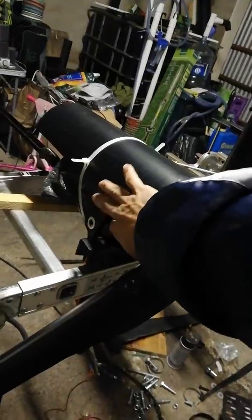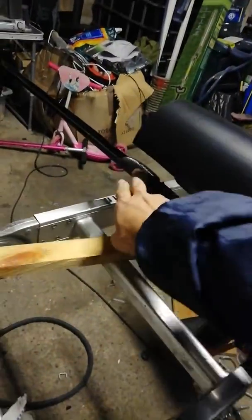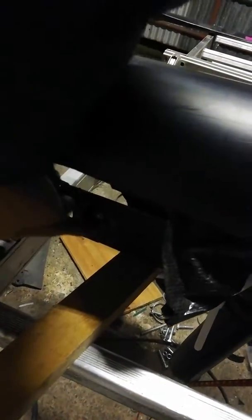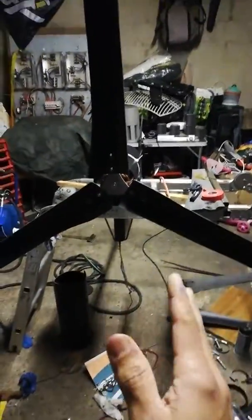The PVC is on top with the treadmill motor inside. I put a bit of trampoline cover over it to keep the water out as much as possible. That's also my furling mechanism — I cut the tail a bit to one side, so the tail moves all the way over, and a spring pulls it back. Hopefully in high winds the turbine will turn out of the wind so the motor won't burn up.